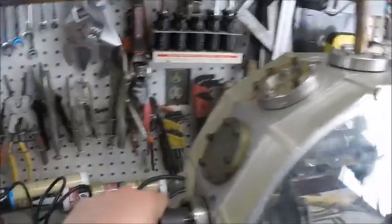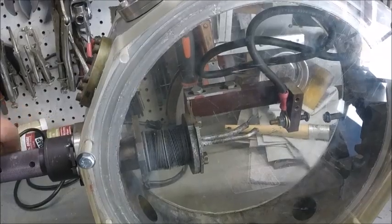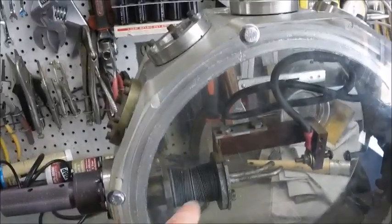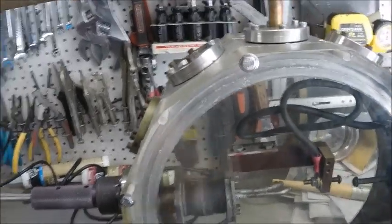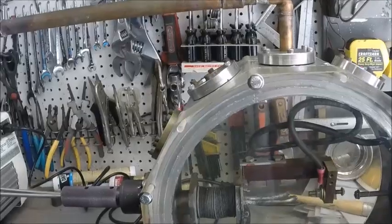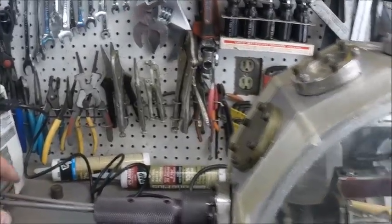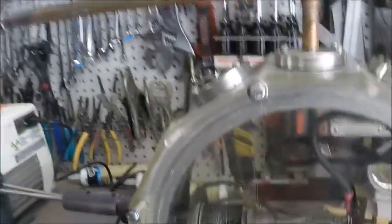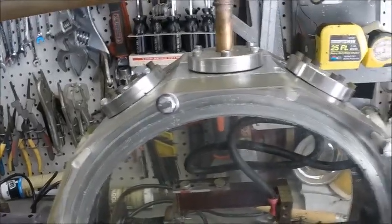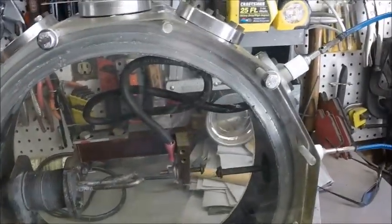This one's unique — it actually transmits motion through a lead screw through a pair of bellows. The bellows are the thing that flexes but also maintains vacuum. It was originally designed for some sort of fluid or pressure flow. I had to cap them off, and now instead I'm using it to move an electrode, which you can see there.